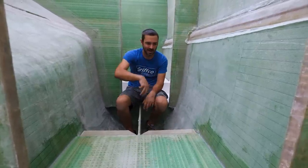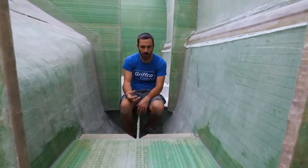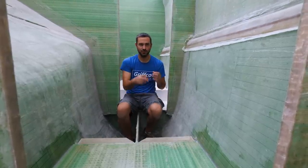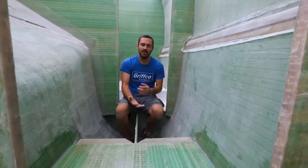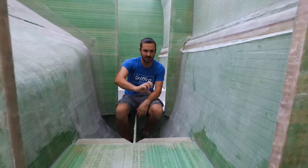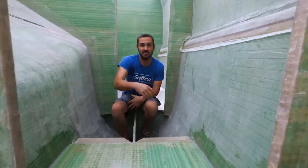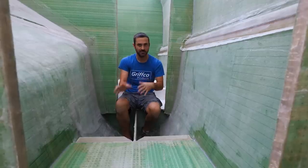The other question is why not have conduit running back and forth to run the wire? That really isn't necessary. Anytime you do a penetration of one of these bulkheads with a piece of conduit, it's very difficult to secure it. You can secure it fairly rigidly, but if we were to hit on the bottom multiple times, there's a pretty good chance it's going to crack - that's the weakest point. And then that's going to allow water to go from this cell into that cell and just keep working its way through wherever that conduit ran. So if we can reduce that, perfect.